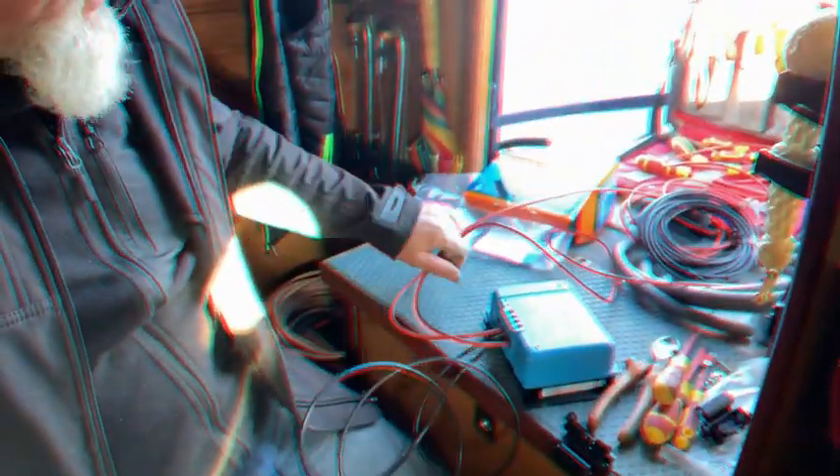This is an isolated DC-to-DC charger — the other one there is non-isolated, which means the negative is common to both input and output. On a narrowboat all the negatives are common — starter and leisure. I couldn't get a non-isolated one quickly, but with the isolated one all you need to do is connect two negatives: one to the input and one to the output, and it works just the same. I've connected the wires in and I'll mount it to the wall next to the other one, and mark which direction each charger is going.